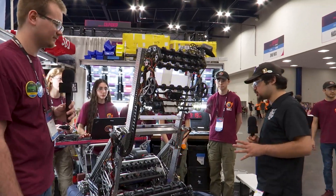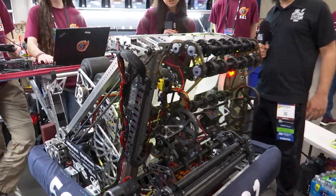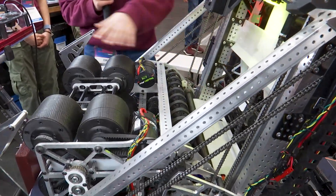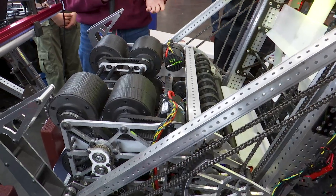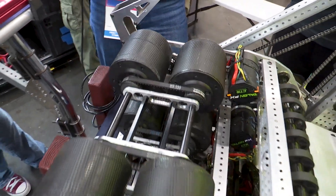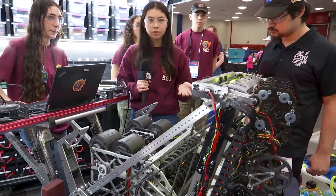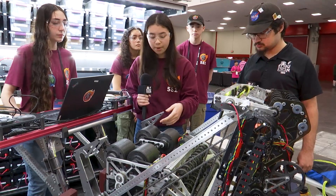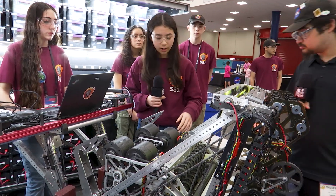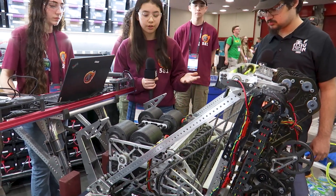Now passing to your shooter — Emi, talk about your shooter, which seems to be on a pivot. So over here, this is our shooter. These are the queue rollers, and right here we have our flywheels. We took inspiration from High Tide by using 1/8 inch polycarb flywheels, then we decided to wrap them in cat tongue grip tape. The flywheels have polycarb and printed hubs that you just push in with bolts. These flywheels run on dead axles, which is really nice because we can have different currents controlling the note on either side.